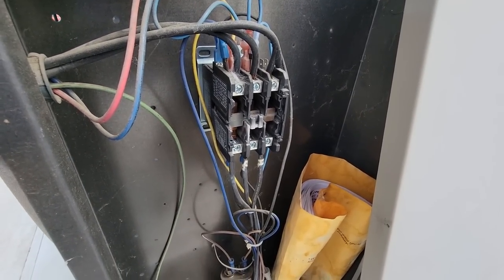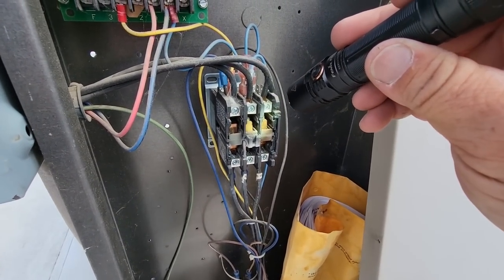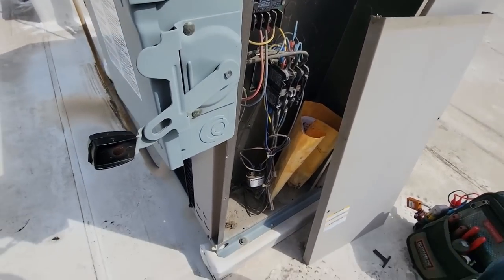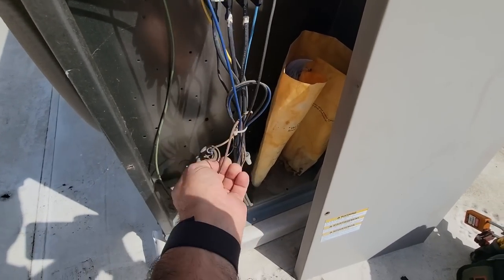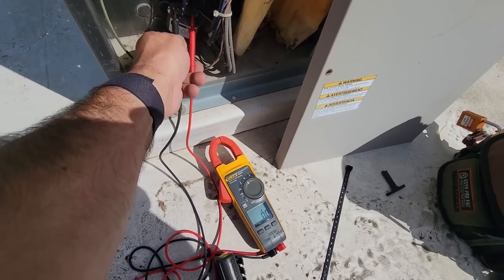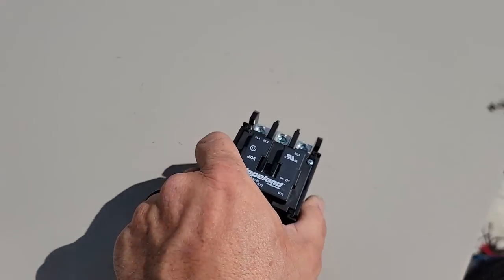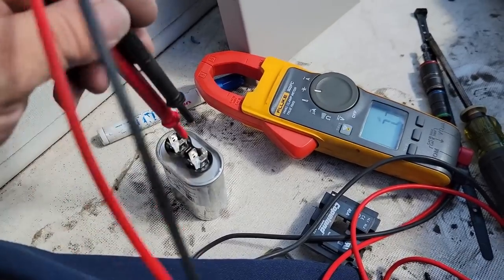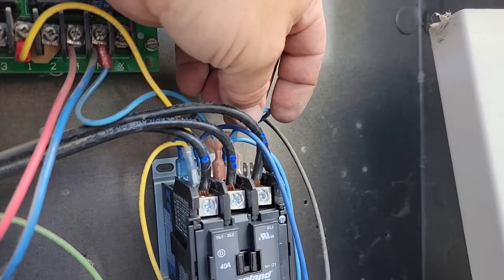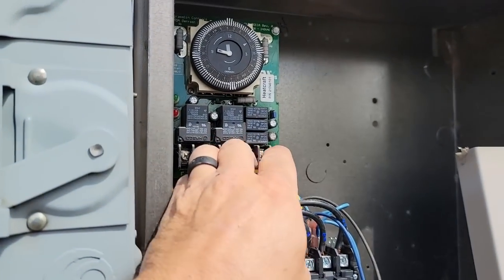Going to go ahead and put it into a defrost so we can start checking these electrical connections. I can look inside at the contactor a little closer. It shut off — killed power. The points are a little pitted. We'll check our capacitor here too since it's just kind of hanging around. I thought this capacitor felt a little warm. We isolated one leg — reading 5.9. I don't need to do the math, that's weak, so I'll get that changed. Got a new clock ready to go, got a new contactor, and a new capacitor. The new capacitor comes in at 7.7. Got the new contactor mounted up. They had some jumpers there — I went ahead and snipped off the ends and connected two under one spade terminal. All we've got to do now is change the clock — should be a pretty easy swap out.